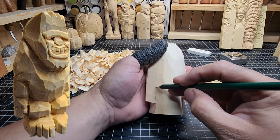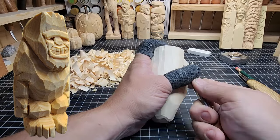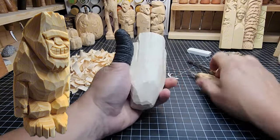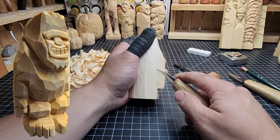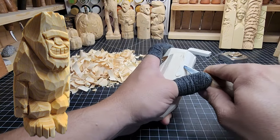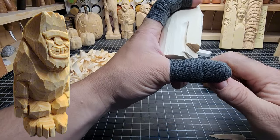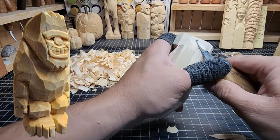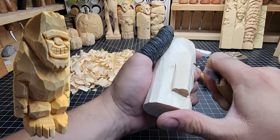Same thing in the back - mark out those lines, make sure they're even with the lines in the front, use this V tool again. You can do this with the knife if you don't have a V tool. I like using the V tool for outlining things because of the way you can move it, swoop in and get where you need to. It gives you more options, and then you can go back in later with this knife, re-carve it to get a better looking channel, which you can do more easily because you made a path for yourself with the V tool. If you don't have one, spend the 20 bucks, get a good one and you'll be quite happy.